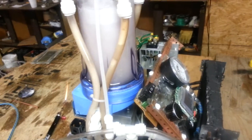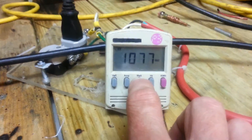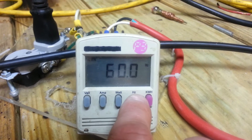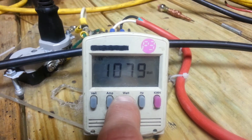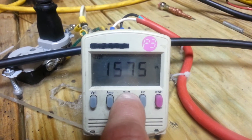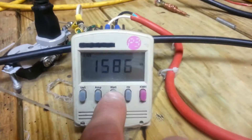We're at about 13 amps here — that's the gas production. This little meter is a pretty awesome deal; you ought to consider getting one of these. This is my wattage and this is my volt-amps, which is different than watts because I'm at a power factor of about 0.68 right now. Actual wattage I'm using is only 1083 watts, but if you were to check it with a standard voltmeter or do the math you'd come up with 1575 watts, which is actually volt-amps. If you know anything about sine waves and power factor you'll understand what I'm talking about, but basically that's that — I'm gonna wrap this up.